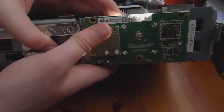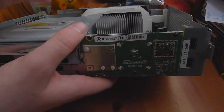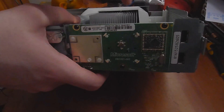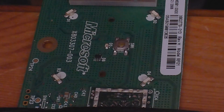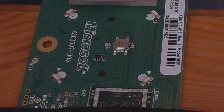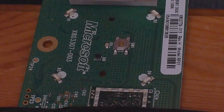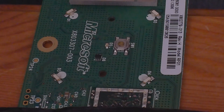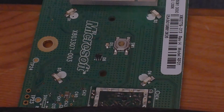Here's our RF board - we've got three screws, one here, one here, one down there. Take out those screws and you'll be able to pull the RF board off the console and start changing those LEDs. Now, you can't just lay this flat on a desk because the slot that plugs into the console will stop it from lying flat, obviously. It's really good if you have some kind of clamp - I've just got to make do with hanging the slot off the edge of the desk and taping the other end down.